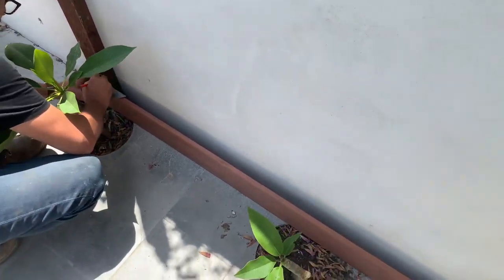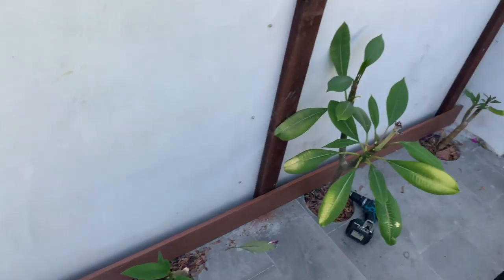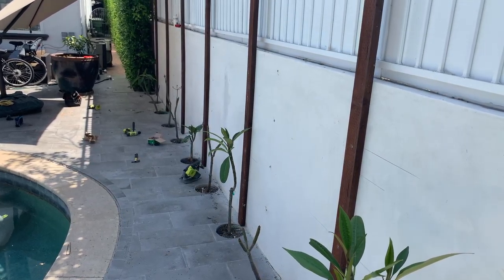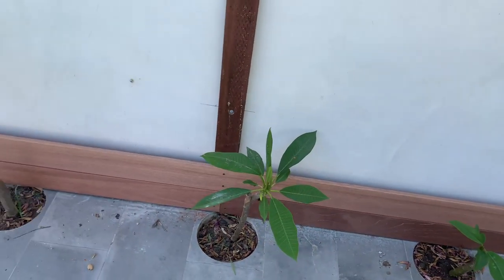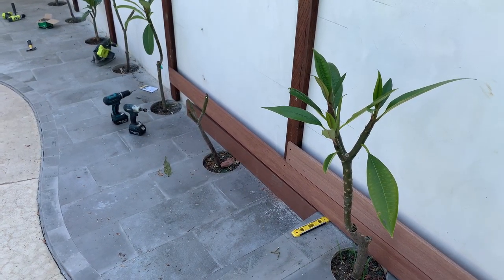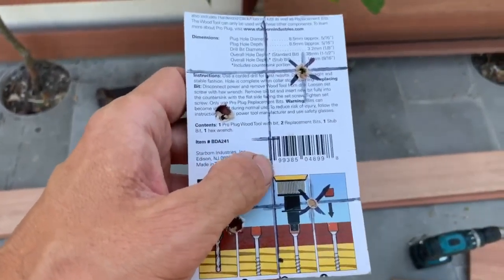We're just praising ourselves for a job averagely done. We have all of the 2x4 boards in — starting at that board, we have them every five feet going all the way across. We're starting off with a ten-foot board, but found out it's actually ten feet and one and three-quarters inches. We have our first ten-foot board screwed into the wall. Now we're going to cut a five-foot board to stack on top of that and go five, ten, five, ten, five, ten until we culminate at the end with either a two-foot or seven-foot board.